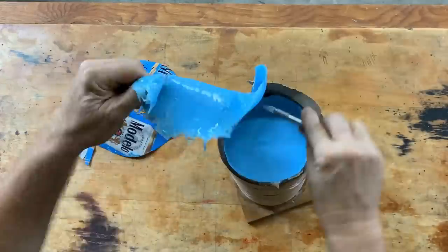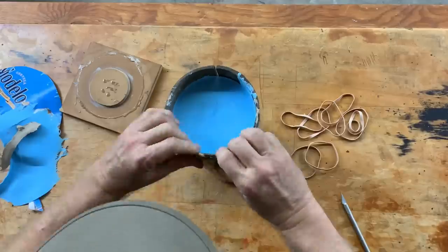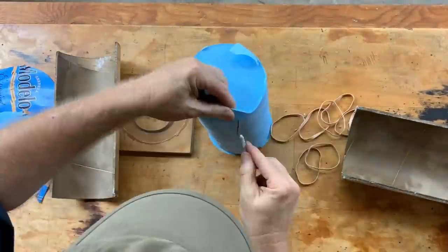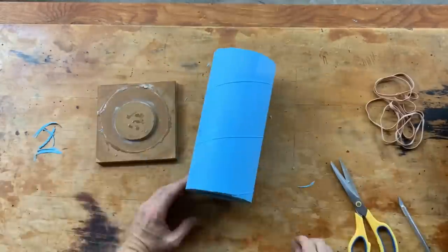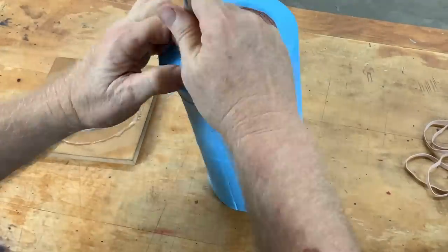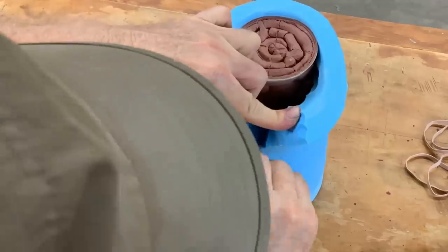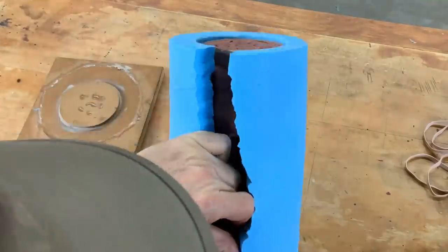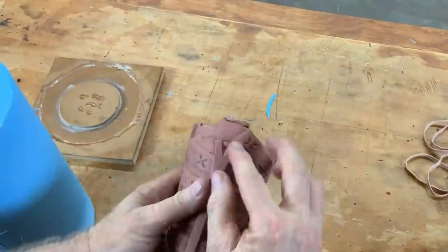Yank the funnel and trim it off. Look how easy this mold case comes apart — that's the genius of waxes in action. They are 100% friendly to the rubber and they also come apart super easy. All right, time to cut the mold. Starting out is definitely the hardest part. The trick to cutting molds is to stretch the rubber as much as you can, try to cut clean and straight at the part, but jag it away from the part so that the mold halves will lock together.